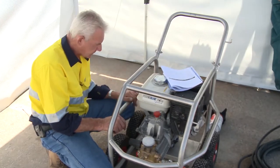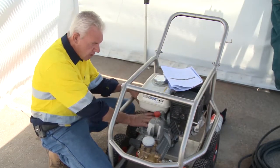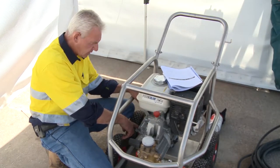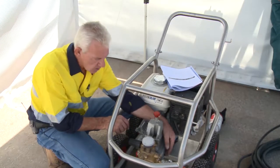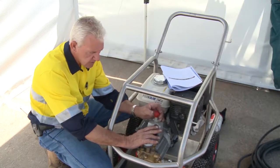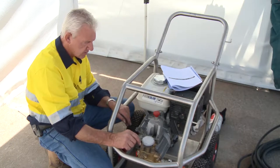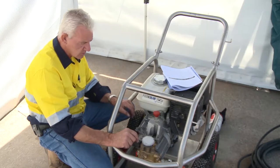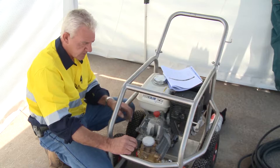Newer model pumps have a low oil cutout — if the drive motor is low on lubricating oil, it won't start and the machine will shut down. There is no solenoid wiring on the pump itself, so it's imperative to check the oil daily and always operate these pumps on level ground. Keep safe by checking oils, ensuring everything is done up tight, and maintaining sufficient clean potable water to drive the pump.